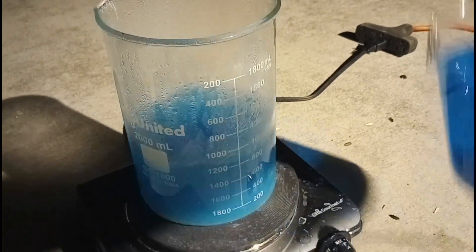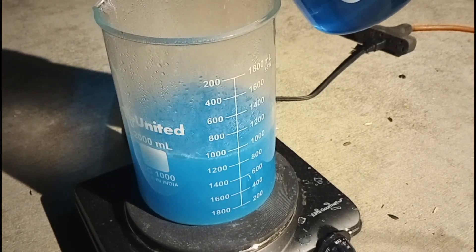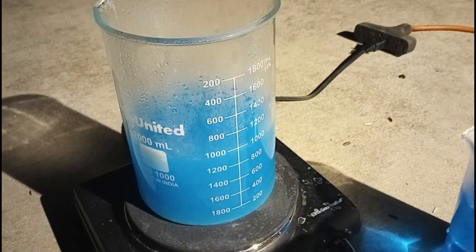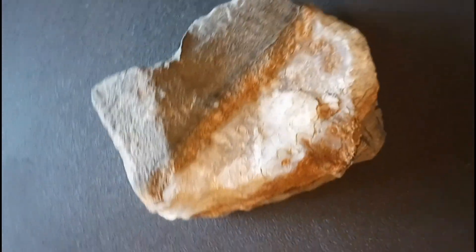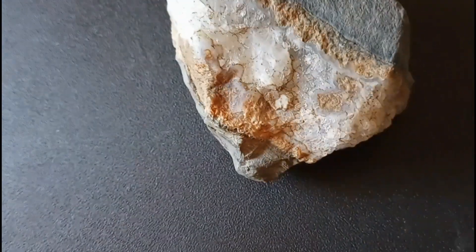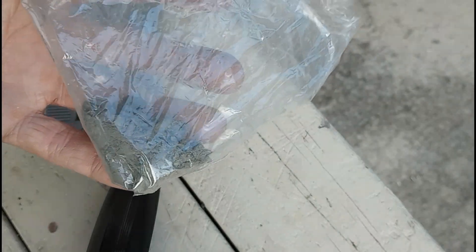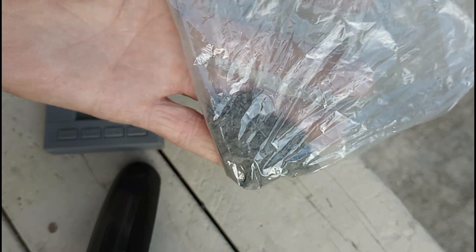So yeah, pickles. Because when jewelers work with silver or gold, they have what they call a pickle jar. The jar contains an acidic solvent, and sometimes acetic acid or vinegar is used, hence the name pickle jar. This is a piece of gold ore. In ores that contain silver, it's also common to find copper and zinc. That's how some could be in there. When I work with silver, I use acetic acid as my pickle, and over the last month or so, this is the sediment that came out of the pickle — a collection from several small batches.